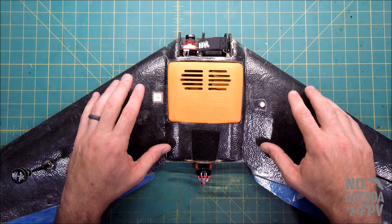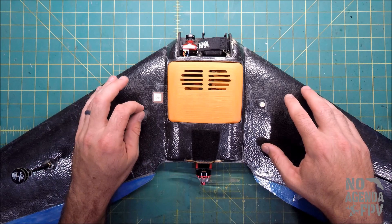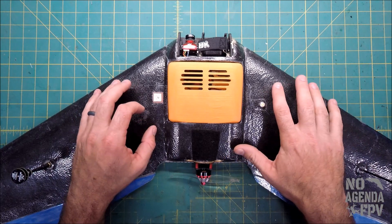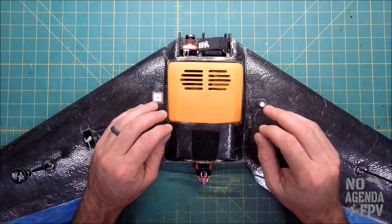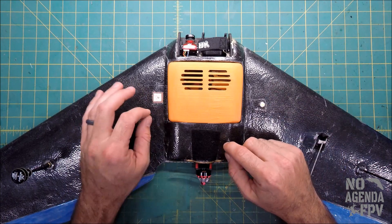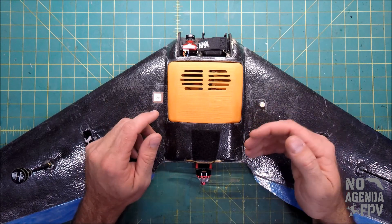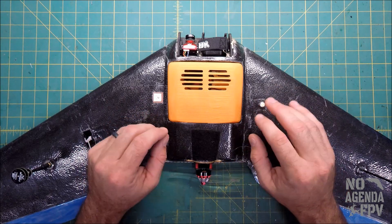The problem with the old method: you would increase your throttle on the radio with the aircraft not plugged in, then plug in your battery. The ESC would get the full throttle signal, beep at you saying it's good, and you lower it back down — and then the ESC would be calibrated.